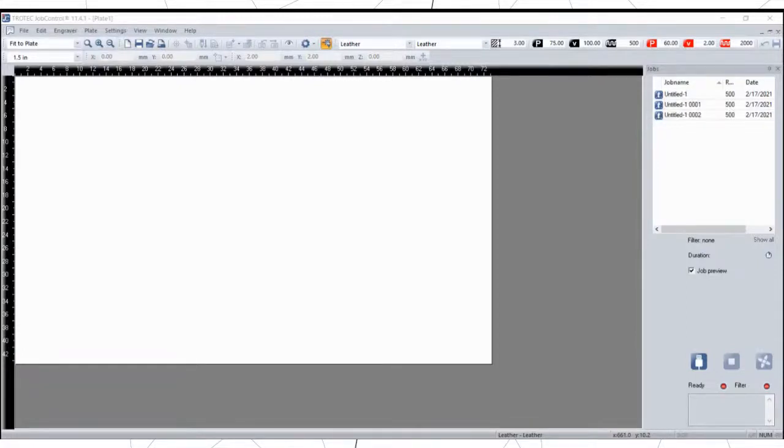I'll give us a second — we just seem to be stuck on the materials database. I've just got Job Control on screen at the moment. It seems to highlight the materials database but I can't see it on screen. Okay, well under each color under the advanced column we can change the correction value. In the advanced column we can change the correction value for each color — this enables us to engrave a little bit quicker. With the nature of a glass tube, sometimes it's not quick enough to keep up with the laser head, so we add a correction value which gives a boost at the acceleration and deceleration point so that we can engrave faster.